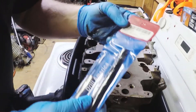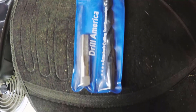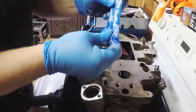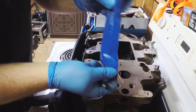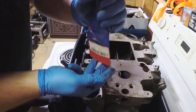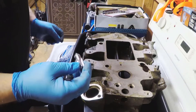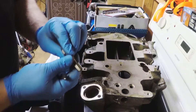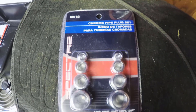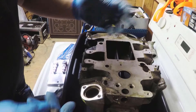To do that, I purchased this quarter-inch NPT tap set which comes with the drill bit you need to drill it out. You can get this on Amazon for maybe $8, so it's not a very expensive investment and definitely worth it. We're going to tap these holes to size, then I bought these Spectre pipe thread plugs — we're going to take the two quarter-inch ones and run them in there with some loctite to seal that off.